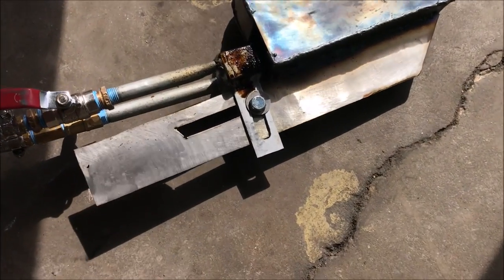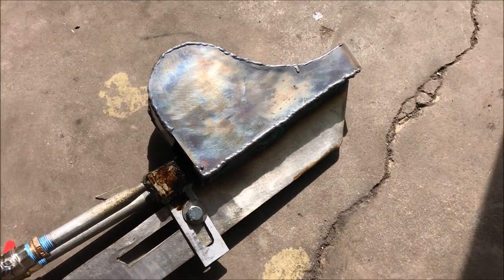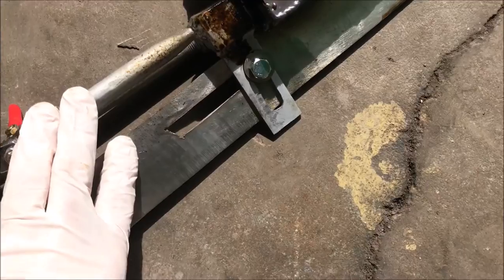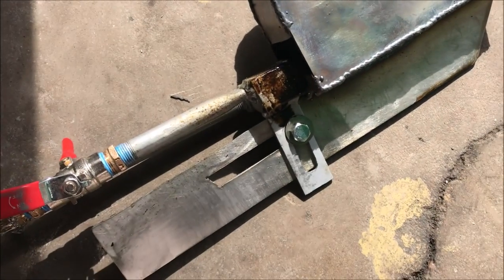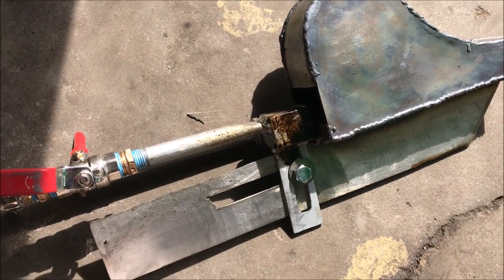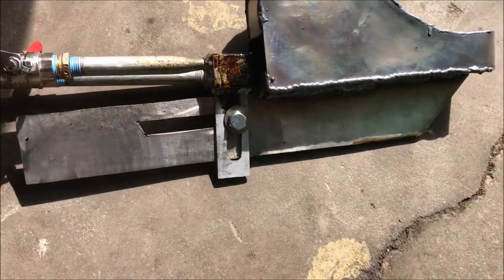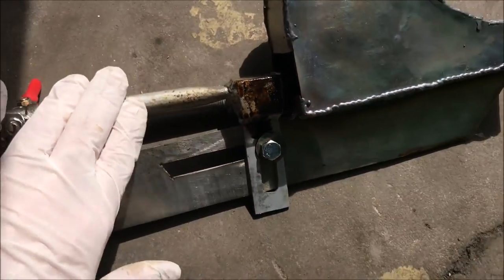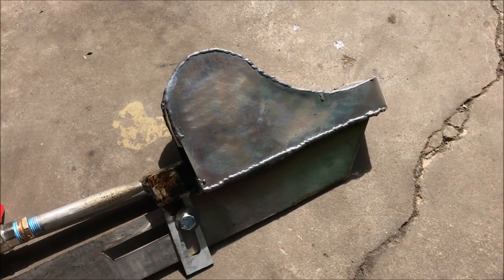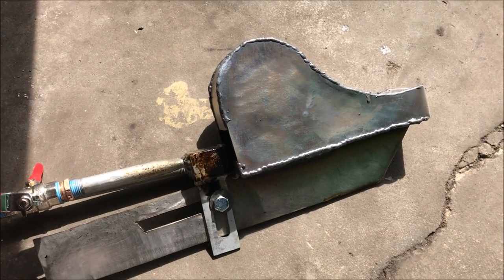Okay, Ivan, I just ran this burner through its paces to be sure that it's going to stay lit and all that good stuff. One thing I can say, to get this thing to run at the 300 kilowatt that you quoted, you will need a fairly substantial air compressor. Possibly even an 8-horsepower air compressor would be needed to give this thing enough air to run at very high efficiencies. Now, it will run with the compressor that I've shown.